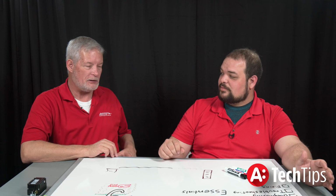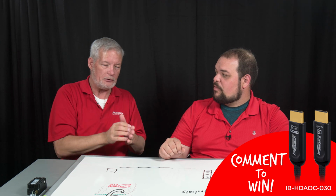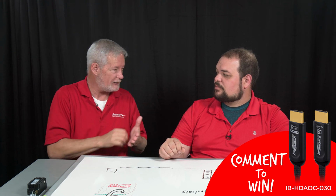And what will happen is if you have a good surge protector or power strip, typically it will have a ground lug on the back. So you will take a piece of the rack, take the panel off, and most rack manufacturers actually provide you a point to do this. Exactly. And you will take a piece of 12 gauge wire, typically braided, so it's a little bit more flexible.